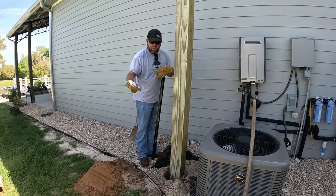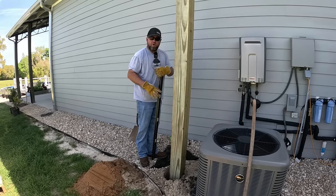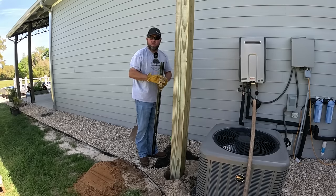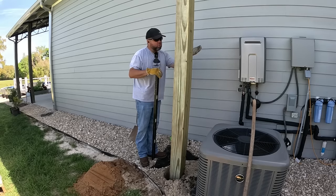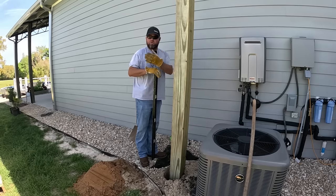When packing concrete around a post, I prefer to pour it in dry and kind of move it around. You can still shift your post a little, get it perfectly plumb, and then wet it up. Or if I'm building a fence somewhere else, I'll let rainwater and natural moisture firm it up. I've pulled posts out before doing this and they're always solid. But to get the strongest mix possible for a foundation, you always want to mix to your manufacturer's specs ahead of time.